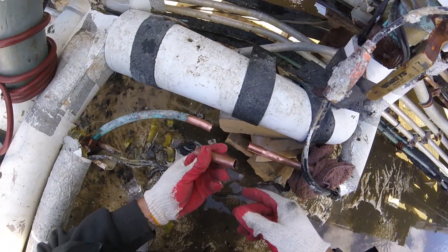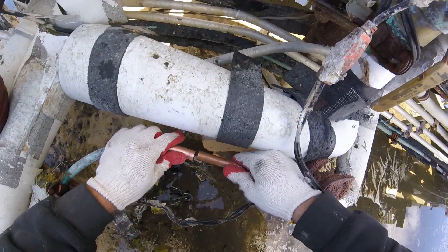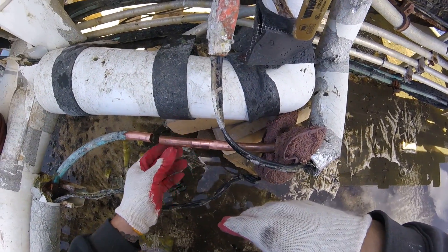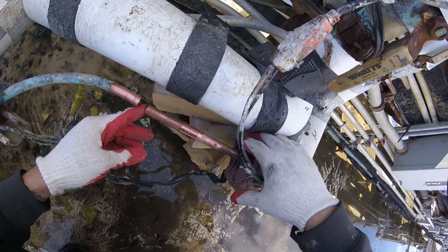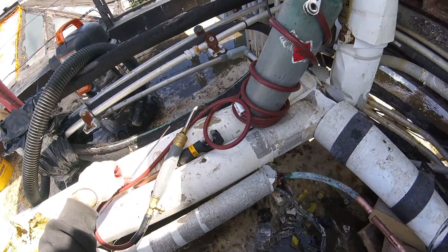Cut a piece of pipe, and another coupling was supposed to go in here, but it wouldn't fit because this pipe actually expanded. So my partner grabs something to round out this pipe. I'm going to braze on what we have. Got a wet rag on here so these wires don't get burnt. We should be all right — start the brazing.